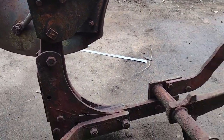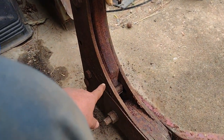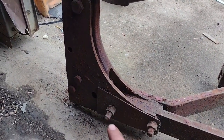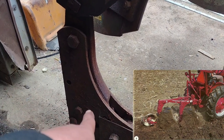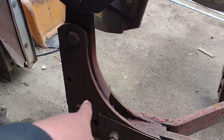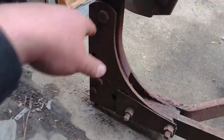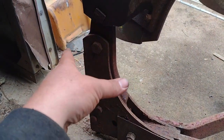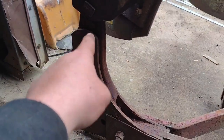This plow came with the '67 140. I checked many times — it's not sprung. This is a trip beam version. There are three different versions of this plow: the trip beam, which was more expensive; then they had a trip beam with a shear bolt somewhere back here — when you'd hit something it would shear that pin, and you'd have to put a new pin in and trip it back. This version — you just back up and it clicks back into place.